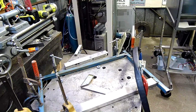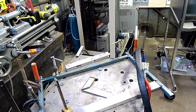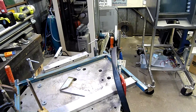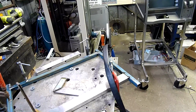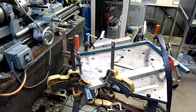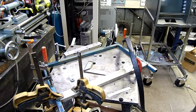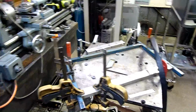At the moment it can only sort of go diamond shape. If I weld a lot of the horizontals incorrectly or too quickly, it'll cause it to bow in all kinds of ways. It's a bit of an art working out which way the metal's going to bow and twist when you're welding it. It's tricky, but very enjoyable.